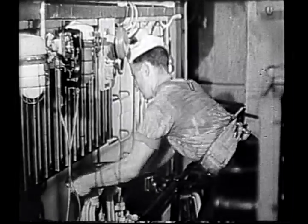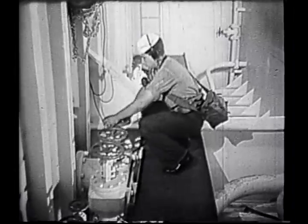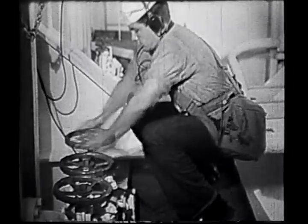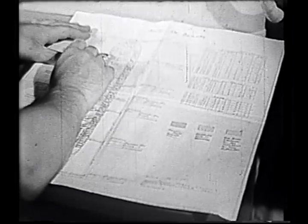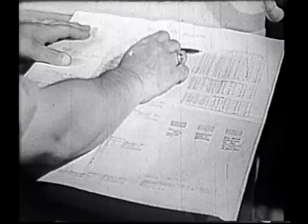This valve controls the three forward tanks as a unit. Additional valves in the bilge drainage room must be used to control them separately. The three forward tanks are primarily used to trim ship to meet draft conditions required for any particular beaching.